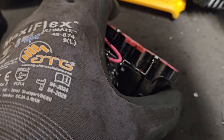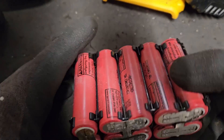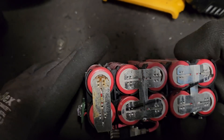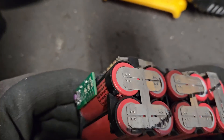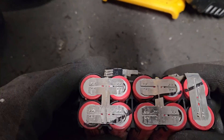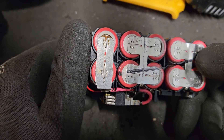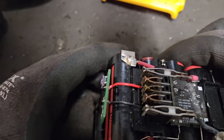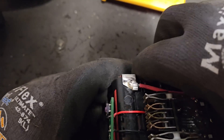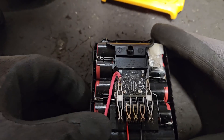This is a fairly clean battery — this is a 2020/2021 battery, so by my standards it's not old. There's very little corrosion, just a tiny bit here. Some of the ones I get are very badly corroded — actually hideous. So that's what's wrong with this battery: there's nothing wrong with the connections, they all look good. The low cells are stopping it from powering the tool and the high cells are stopping it from charging — that's what cell imbalance does to your battery.